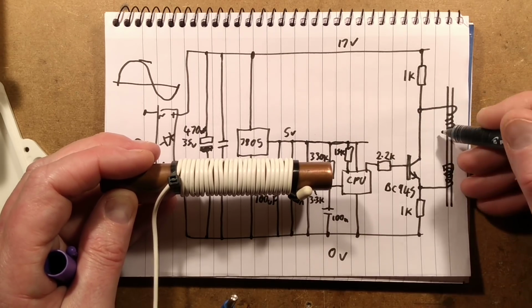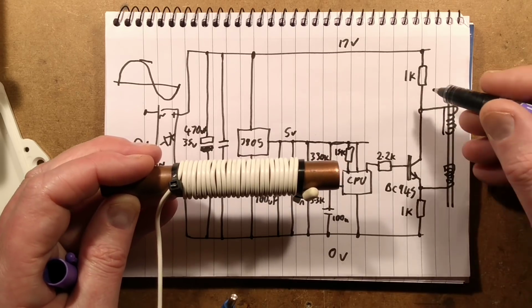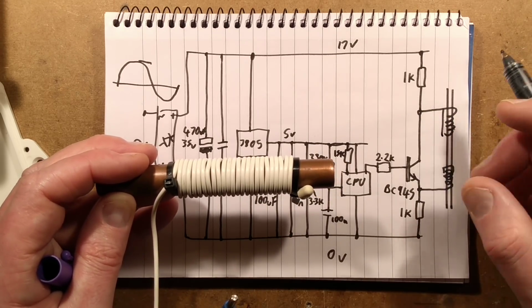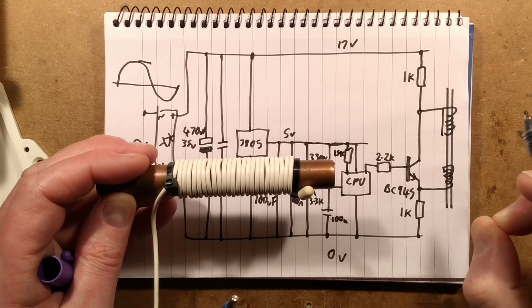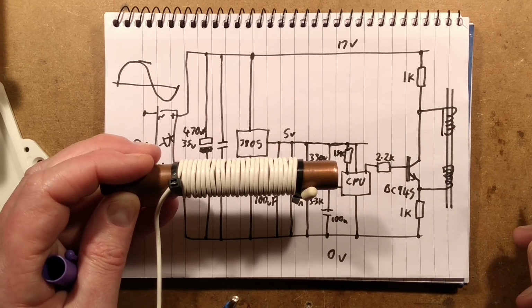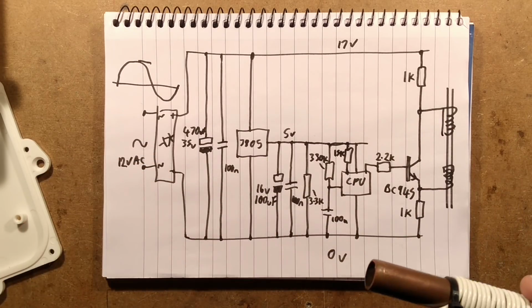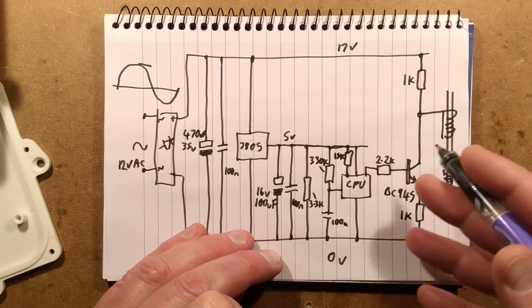And even taking into account that if these were capacitors coupling onto the pipe, then charging it via a 1K resistor, and the way the transistor is being driven here, it's just tiny little pulses at a ramped frequency. And it's an audible frequency. If you do stick the headphones in, you get a very distinct sort of trilling noise from the actual swept frequency.